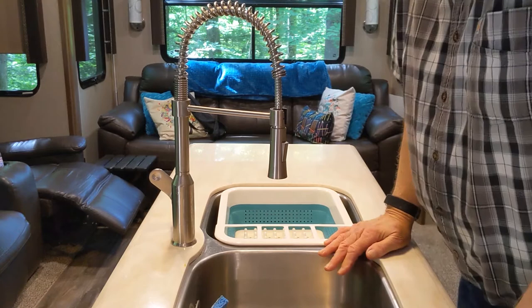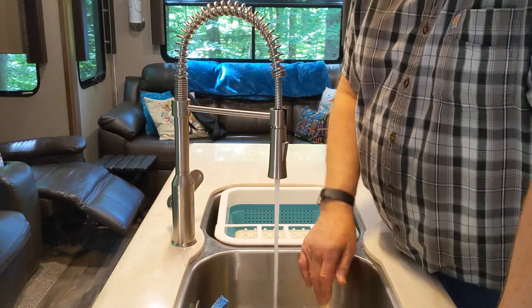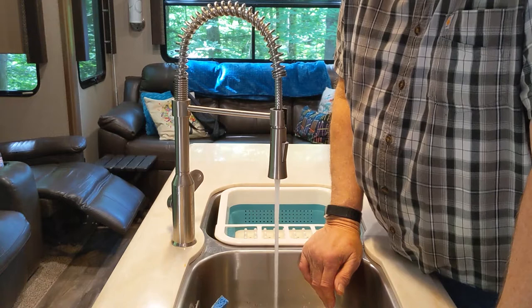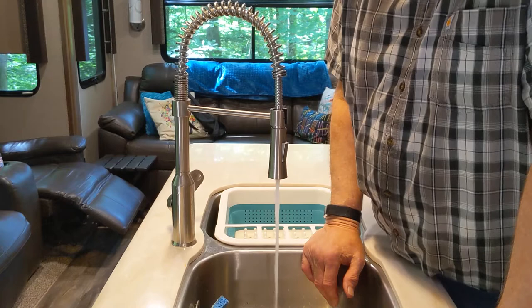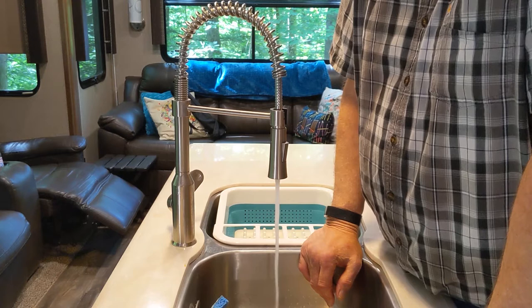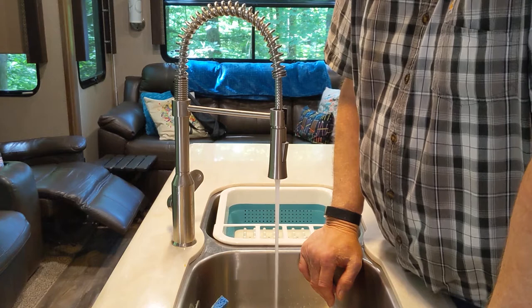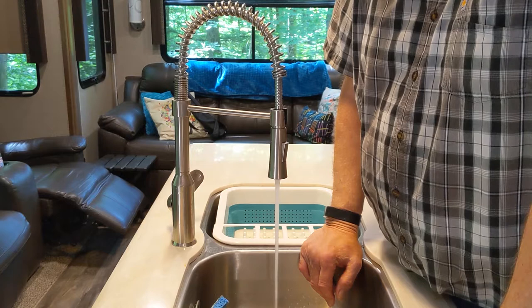We're here inside at the kitchen sink. We're going to open up the hot water side. It seems to be running pretty good, but you really want to let it run for a while. Open up the bathroom faucet too — there you go, you can see it sputter; that's from the air that got into the line. We really don't want any air left in the line when we turn on the heat, just to make sure the heating element is underwater. If it's not, it'll burn out instantly — that's one big mistake a lot of people make when starting out.